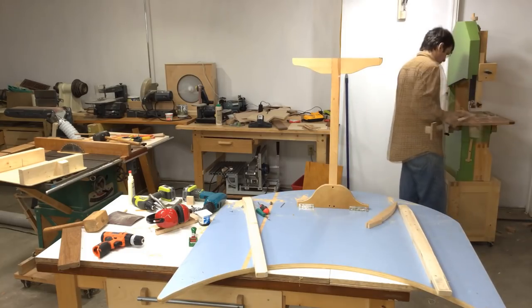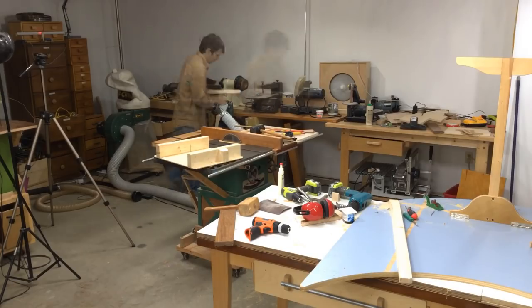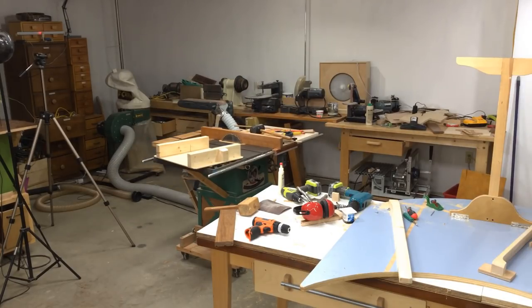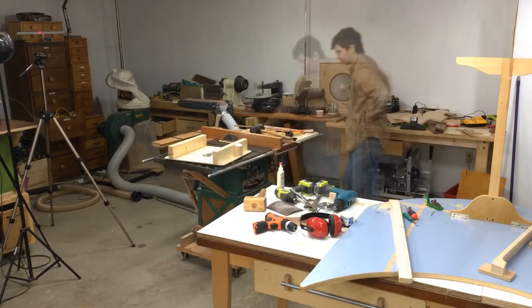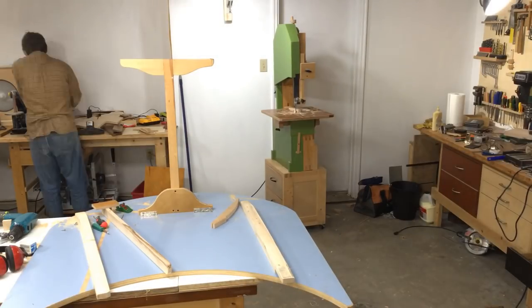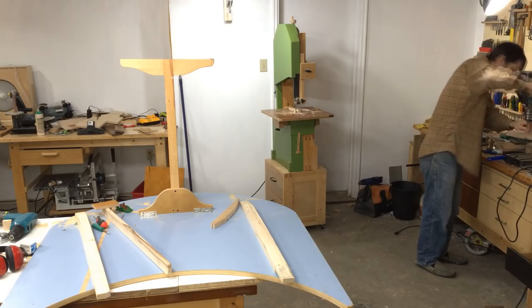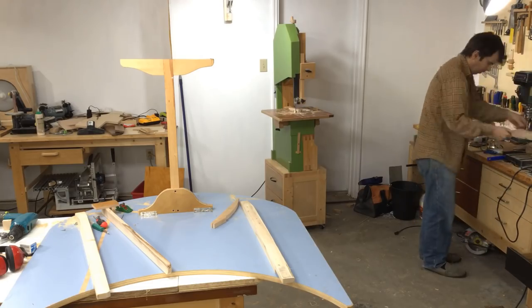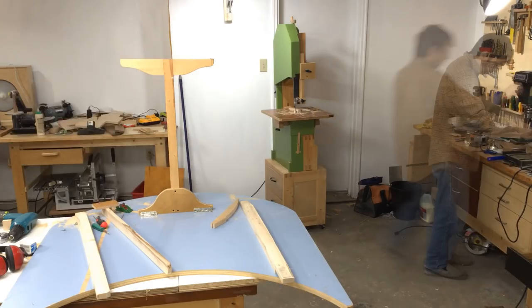And now figuring out where that brace is going to mount, and rounding it some more and cutting it to length and sanding it some more. And you can see there's a piece of plywood mounted to it just bottom right on the frame there. That plywood makes it wider so I can put more hinge on there. And cutting another piece of the piano hinge to just the right length. And it only had two holes in it after I cut it, so I drilled a bunch more holes into that hinge so I could have more mounting points on it.